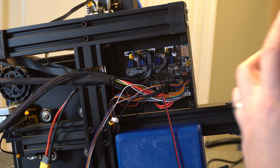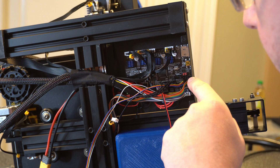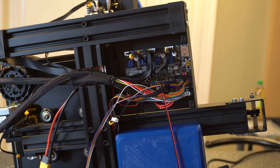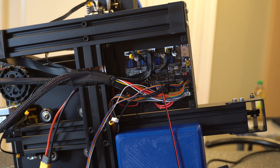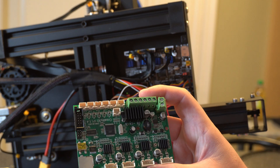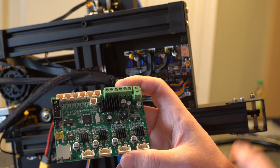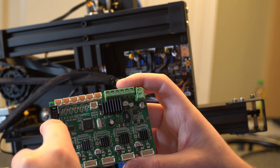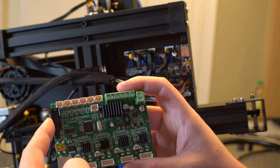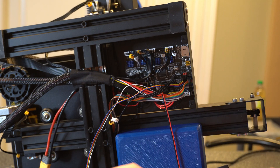Alright, so that's for the V2. If you have the V1.2, it has two of the EXP ports on it — that's where you would have to use both of the ribbon cables that were provided, and then it would go from EXP 1 to 3 and 2 to 2. It's kind of difficult to show you guys that because I don't have that board, but if you have two of the EXP ports on the board then you're going to have to run both of them. The display is supposed to be able to work with the original board too, at least in Marlin mode — you won't be able to get the touchscreen mode because it doesn't have the serial connector. But if the board you're using has two connectors then you're going to have to use both of them. If it only has the one like the SKR Mini V2 then you only have to use the one and that'll go straight to the EXP 3.